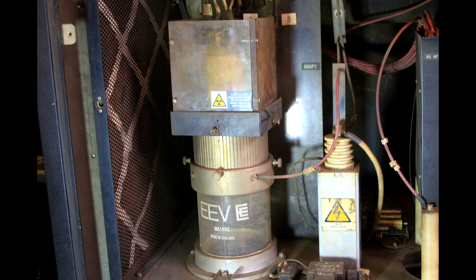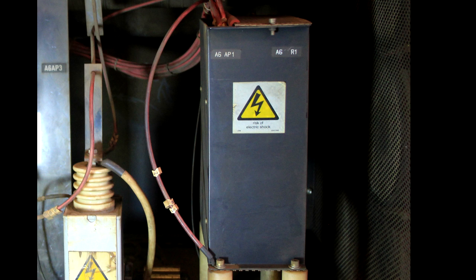There's a large fan-cooled wire-wound current-limiting resistor along the back, and this goes into a large control valve — I think a triode valve. I'm not totally sure whether this is just switching or also providing power control. I suspect it may be operating in linear mode or some pulsing mode filtered to reduce beam power. There was one additional component behind it which looks like a large transformer or inductor; it may be used to produce a high-voltage transient to start the tubes, or it may be involved in current regulation.